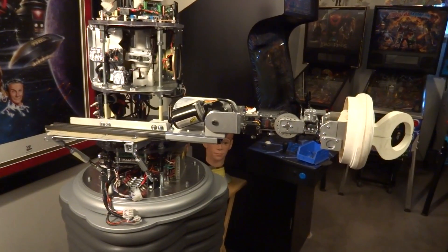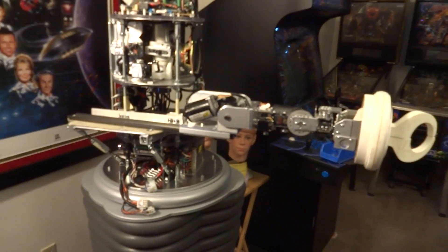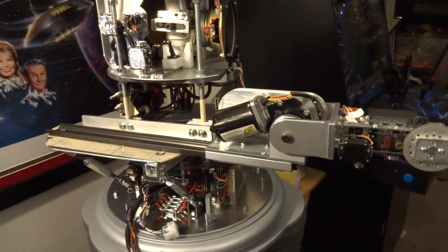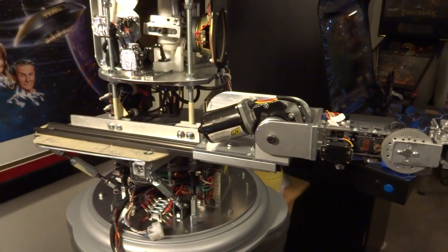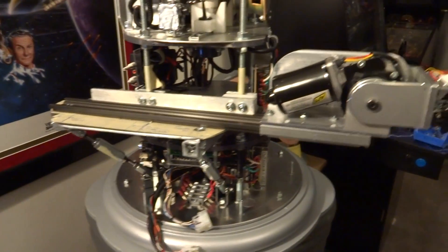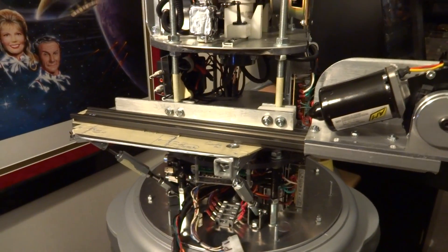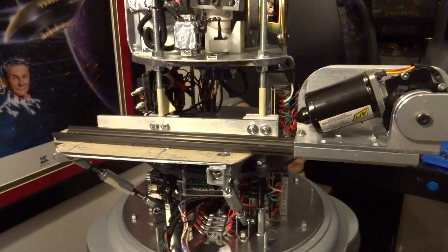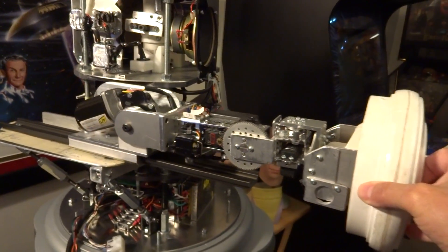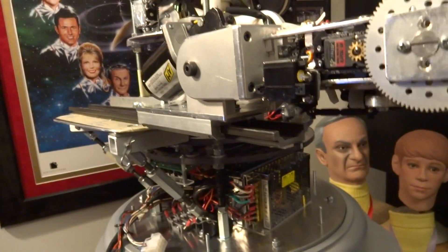So I built it where I can disassemble it through the front hole and from below in the torso lower vents. You know that it's got a 7-inch hole that this arm goes in and out of, and it's big enough to fit my hand in there. I built these components big enough where I can put most of them in through the front of the robot and manipulate everything from the bottom and take it apart and put it back together. This arm actually slides in and out, and it'll slide right off of that rail right there, so that's easily removed.